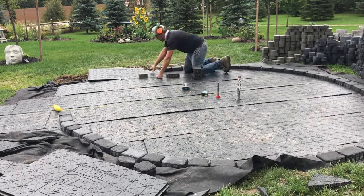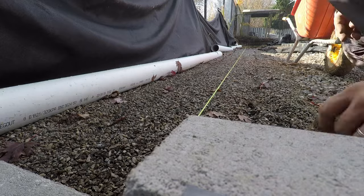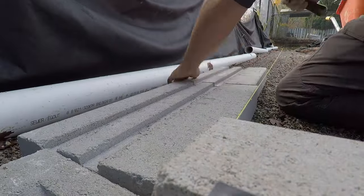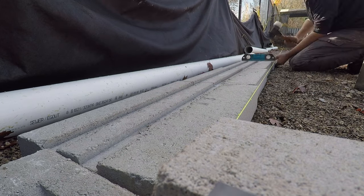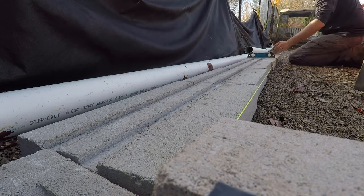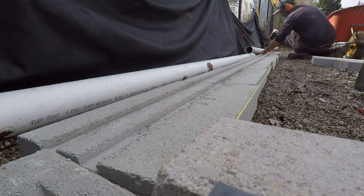You can also use paver base panels for walls under 18 inches in height, gas fire features, and steps under 18 inches in height. Now, I have never personally used synthetic base for walls, because when we're doing a wall we're typically also doing a patio with it. When that patio is on a slope and the paver base panels follow that slope, we don't want our wall to be on that same slope. So typically we don't use paver base panels for walls — we'll just do a traditional or open graded base for those walls.